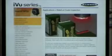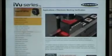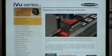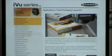So we have date lot code inspections, drilled hole assemblies, marking. You can also use external light. Here's an example where we didn't use the built-in light, we used external lighting. It's not very often you need to do that, but for some inspections you will get better results. Here we're looking for a pattern as it's moving 360 degrees potentially down the conveyor line.